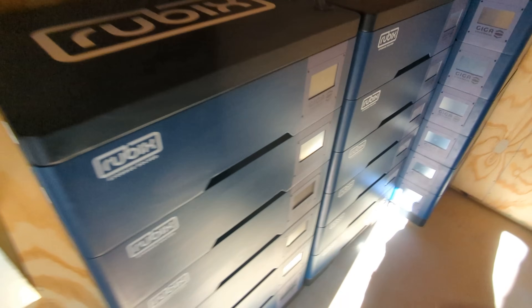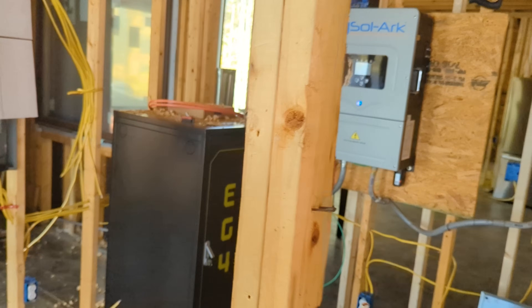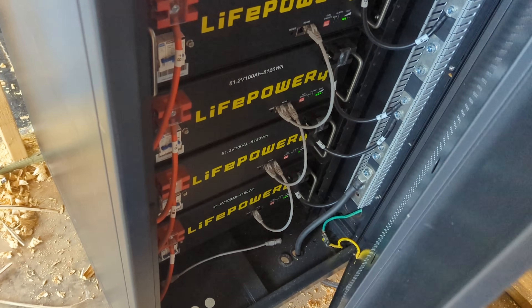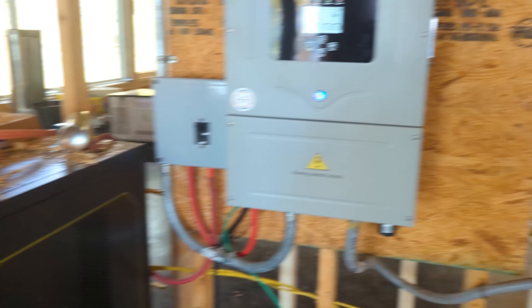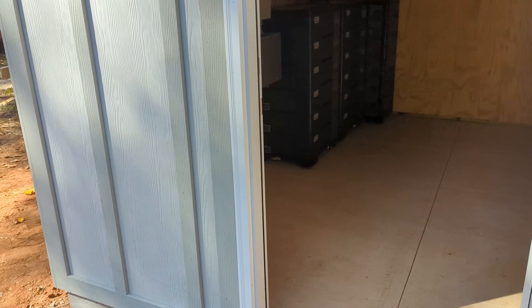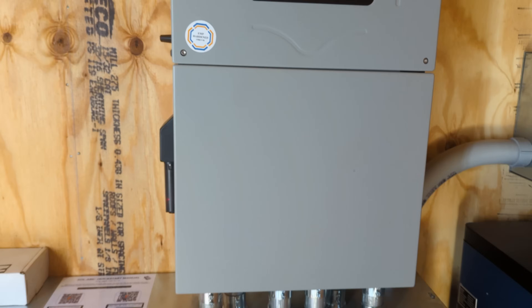We're charging the batteries up. The reason they found me is this original homeowner had an 8K system installed — they tracked me down on YouTube. The 8K with a couple of VG4s, lead acid — those weren't charging quite right. All of that is coming out. This panel ran the house, but you can see it's pretty much gutted now and they put a new QO panel in. It's over on our system now with a 200-amp disconnect on the house and a nice mechanical room. We're making 13.4 kilowatts off the top of the hill.